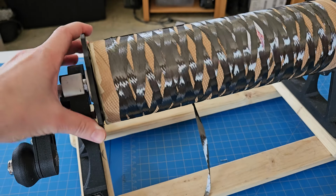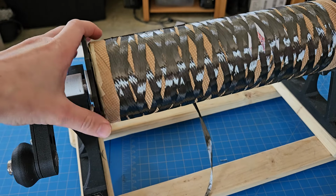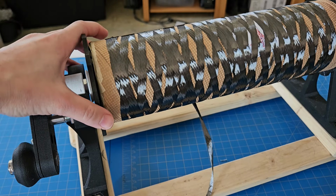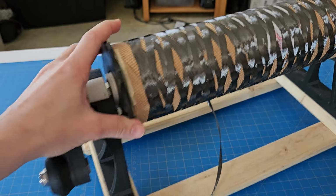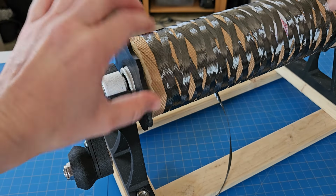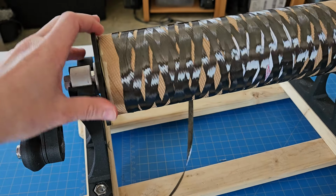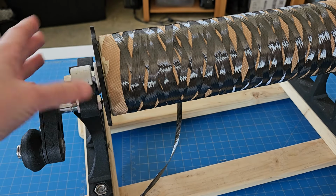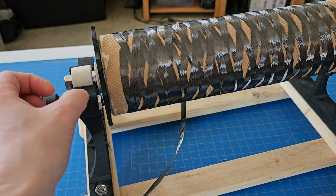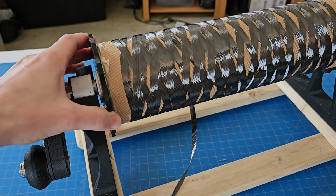Okay, I remember now one of the problems that I was having with this. It was glued in here, but sometimes it would get unstuck, and it also just didn't necessarily fit with the tube super well. They were kind of different sizes sometimes, so it wasn't entirely my design's fault. But this would get unglued sometimes, and then it would travel out, and then it would hit against the sides and create too much friction. It wouldn't spin properly. So this very simple design, not having anything that's grabbing onto the actual part here, just wasn't good enough.